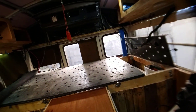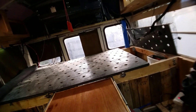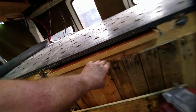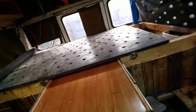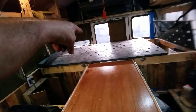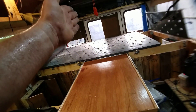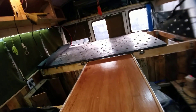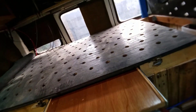I have a 35½-inch table that slides out like that. I'm going to put a little metal bracket right here that will swivel up and lock into certain positions on the bottom of the table to stop it. It works very nicely. I had to do a little adjustment on the back side — I was off by a quarter of an inch. It wasn't perfectly parallel, so I had to move this leg out about a quarter of an inch in the back. Everything works out fine — slides in and out great.